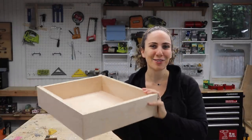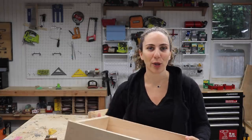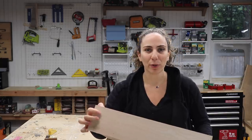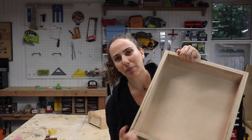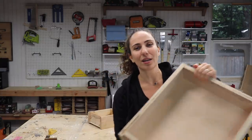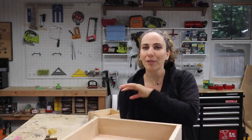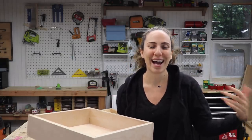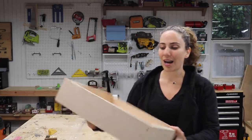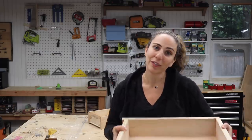The drawer is finished, complete, and square, and I'm really happy with how these came out — they're really strong and should last. I did not reinforce the dado in the back; I think there's enough holding power that it won't come out, since most force comes from the front when people pull. I might reinforce it given my kids, but I'm really not sure if it's necessary. Now I need to plug up the holes, paint them, and finish up the rest of the project. Thank you for watching — I'll see you when it's finished.